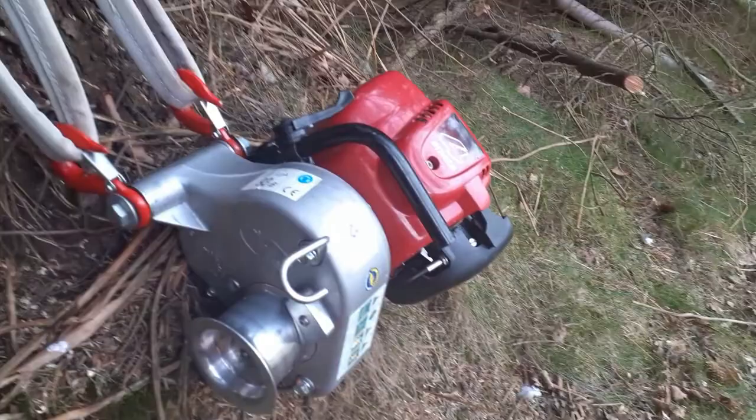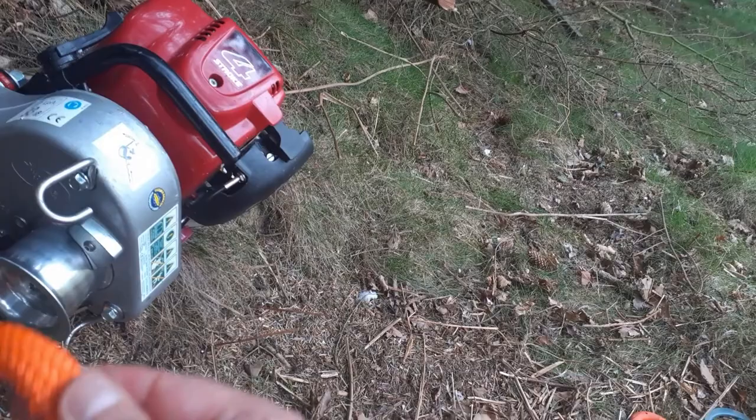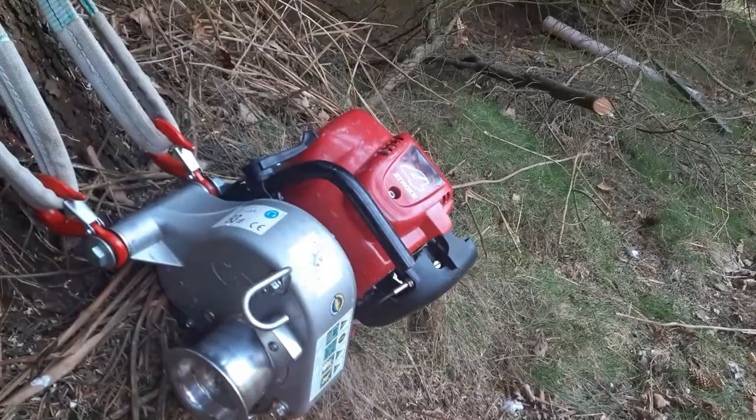Okay, so this is the winch, and this is the rope we use, and it's double braid rope. It's a specialist rope you use. You can't use a regular rigging rope. It'll just melt it. This thing's actually designed to sort of flex. You can feel there's a loose separate core inside there.